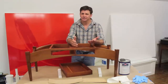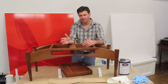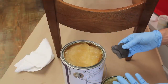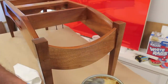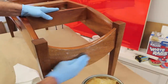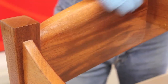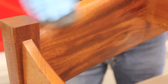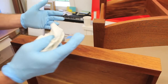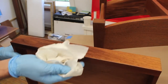As for the top, I'm going to repeat the sanding and applying the finish probably three or four more times, because that's really where most of the wear and tear happens so I want a couple more coats there. This is a brand new can — my last can lasted me almost 20 years. To rub the finish out I'm using a little bit of the Wool Lube paste and gently rubbing in the direction of the grain with 4-0 steel wool. See that shiny surface? The Wool Lube mellows that out and smooths the finish. After rubbing down the piece with the steel wool and Wool Lube, the next step is to remove any residue with a clean paper towel.